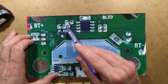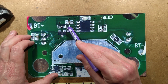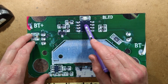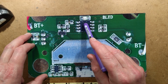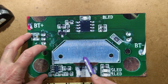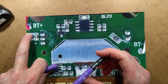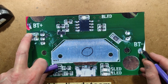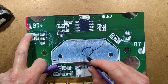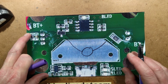It's got a 2000 ohm resistor, 200 ohm resistor should I say, 20 and 1 zero, going to the gate or base from that pin. So when this chip decides it wants the light on, it turns this transistor on, which then the current from the LED through the LED here, the LED is underneath here. The current is coming from the negative supply, going through this 2.2 ohm resistor, through the LED, and then up to that transistor, which then switches it to the positive rail.